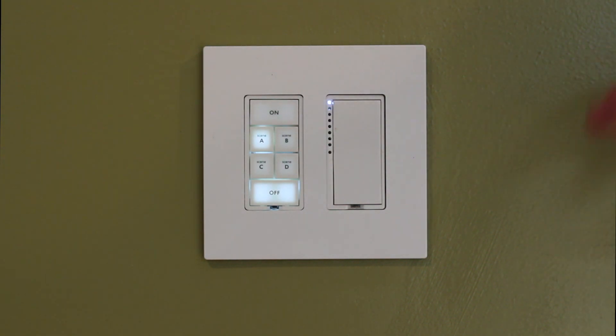For purposes of this video, we're going to show you how to multi-unlink a device. The only time you'd really use that is if you've already linked maybe more than three or four switches to a single button or switch, and instead of going back each time to put it into unlink mode and unlinking those switches, you actually want to just do it once.